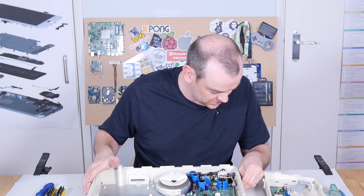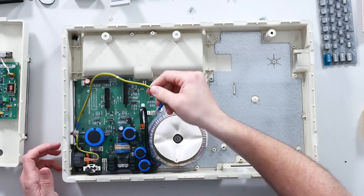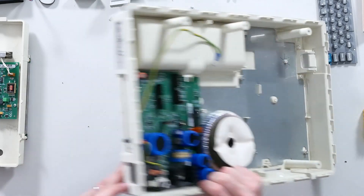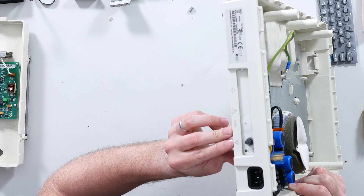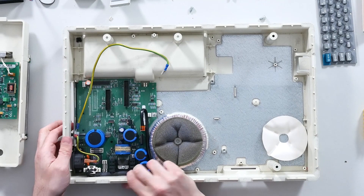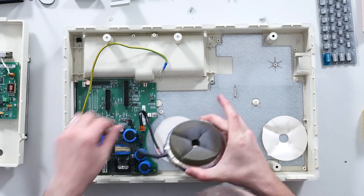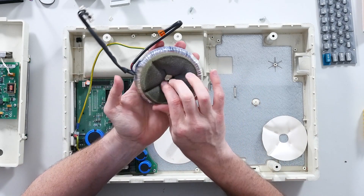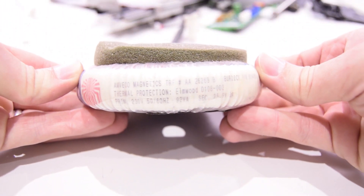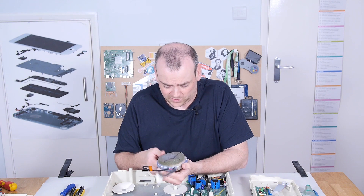Back in the box, there's some enormous earthing going on — that's about four millimetre cable, maybe even six. That's the external symbol for a clean earth connection, so when you wheel this into a room you can plug that into a clean earth. And much like the high-end audio kit we looked at, look at that beautiful toroidal transformer — 92 VA, or roughly 92 watts depending on the power factor. Secondary at 25.5 volts at three amps.